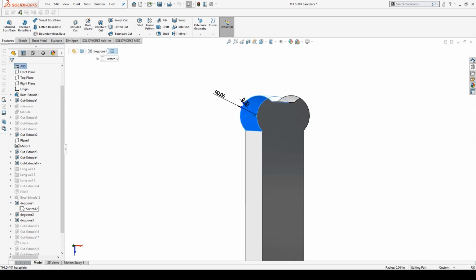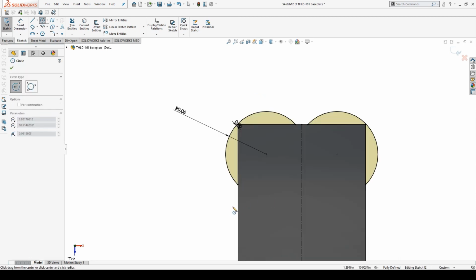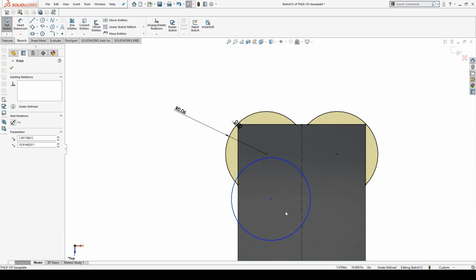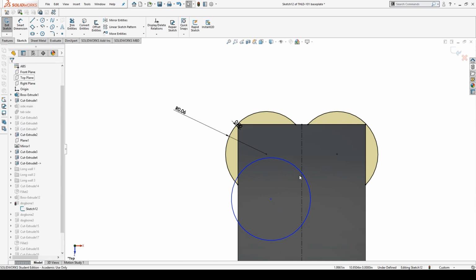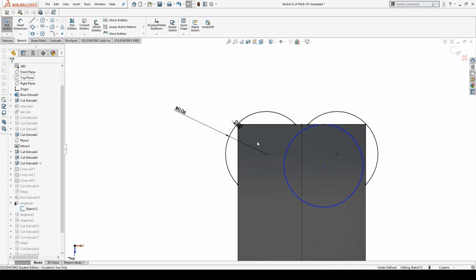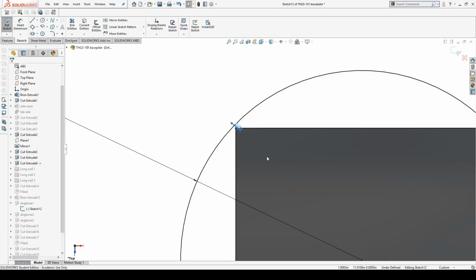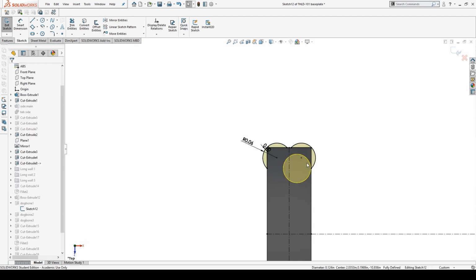What a dog bone is, is a thing that lets the end mill come in. So if I have an end mill, say this is my end mill here, the end mill's got to come into the slot, and obviously if I just go along this rectangular slot and come around this way, the rectangle's not going to fit in there because it's going to leave material right in this corner over here. So a dog bone is basically just a way to ensure that the tool goes in, rolls around, and comes out, which ensures that a corner can fit in here. And I've got, I think, a 1,000th of an inch clearance there to guarantee that a rectangle slot or rectangle tab will fit into there.